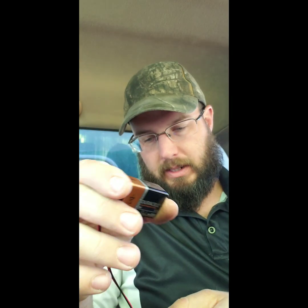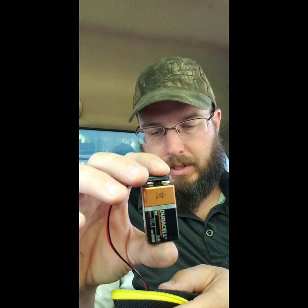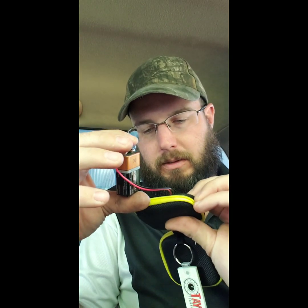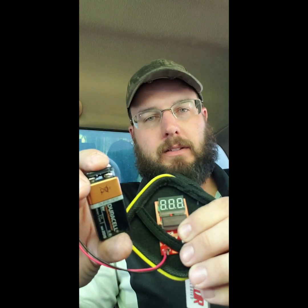Really, having this analyzer is the only way. That battery is a dud, that one's a dud. Here we go — 7.18 volts, and then we push the button and we're all the way down to 2.9. One, two, three — yep. This battery is also no good. Still got some bite in there — junk, throw it away.